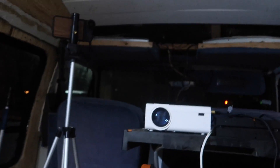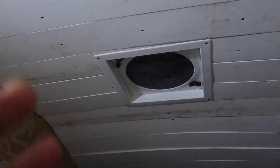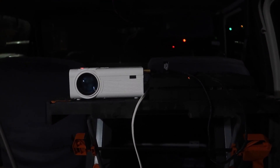The last thing I need to talk about is DC power versus AC power. DC power is direct current and you can run devices straight off DC. For example, this roof vent fan plugs directly into the battery and pulls power out directly. But most household appliances are made for AC power, which is why you need an inverter to change from direct current into usable power for regular appliances. When you use direct current, it's actually more efficient and you use less power from your battery — but most people aren't going to get DC-powered TVs and such, so you'll end up using the inverter for those. The power loss from using an inverter is really insignificant.